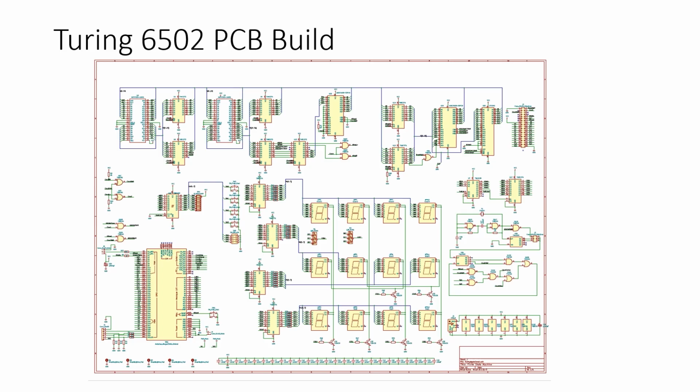If you look at the schematic more carefully, you'll see that the middle row actually has 2 74HC374s driving it. And this is basically because the blue LEDs aren't as bright as the red or green, so we want them on twice as long to make up for it.